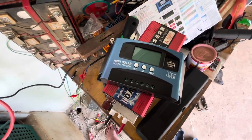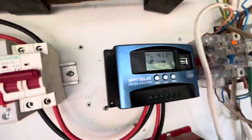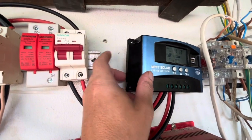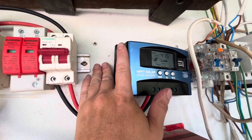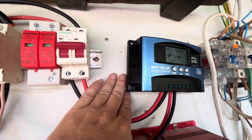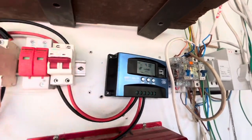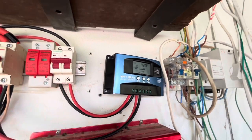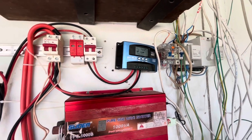It is going up in temperature, but another thing I must admit: when I kept retrying the 100 amp unit, I didn't attach it to the wall. That could be the reason — the wall helps it dissipate heat. Even with just a little breeze going around the back it helps, because the wall acts as a heat sink. Today is also a particularly warm day.